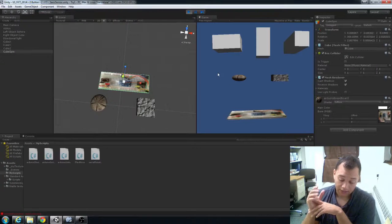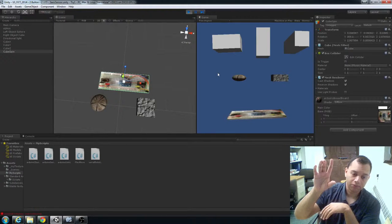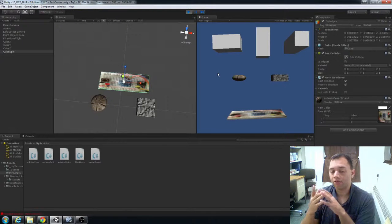So what I'll probably try and work on over the next month and a half is to get 6 potentiometers set that way. 2 for the thumb, 2 to measure the index finger, and then I'll probably just calculate the 3 other fingers, your pinky, ring finger, and middle finger, all together, because it's not too often, except when typing and stuff like that, that we actually use those fingers independently. By the time you start flexing those into a grip, you're trying to hold something sturdy or of weight, or hold it firmly, because you couldn't hold it with your index finger and your thumb. So that's kind of where we're going.